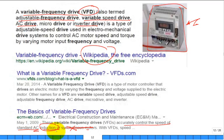So it's not going to run precisely at 1800 RPM or another increment like that. It'll have a little slip speed, and that's what gives it the torque and makes it the motor. Synchronous means it runs right at that speed. It's in sync. Forget all that. I'm not trying to teach motors.